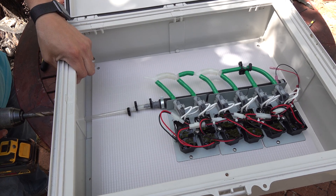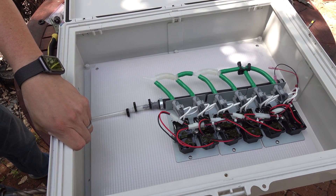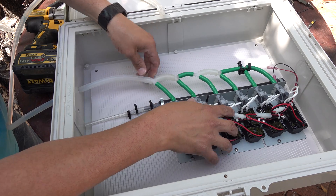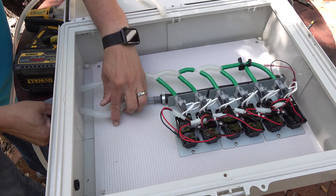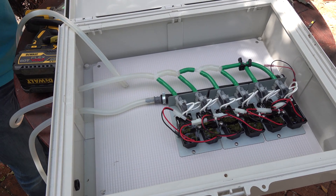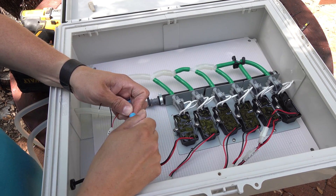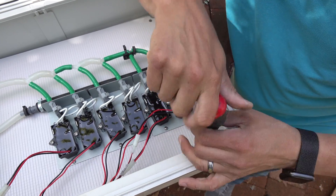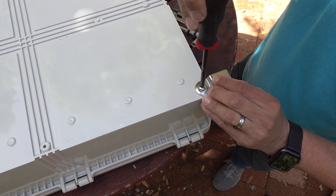With the tubing locations roughly marked, I can now make the holes in the project box. We drill one hole for the input, one for the output, and one for the power cord bulkhead on the other side. Pull the tube through the opening, connect it to the fittings on the inside leaving a little slack, and the hose for the ozone output goes in the same way. If any fittings feel a little loose, use a hose clamp to make sure they're nice and tight. Next we make the electrical connections using wire nuts or your preferred connector, then screw the project board to the enclosure case and attach the mounting feet to the back.